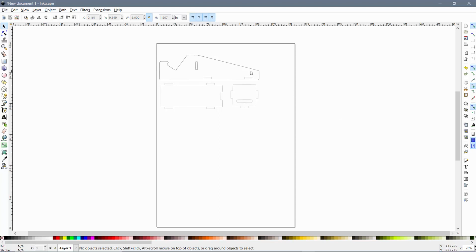But before I do that, usually the laser cutter, the way it works is it follows based on color, right? So you can set a color to be a certain power and speed level. And usually the color for cutting, right, we want the laser cutter to cut all these edges as well as our holes. The one you want to use is red.